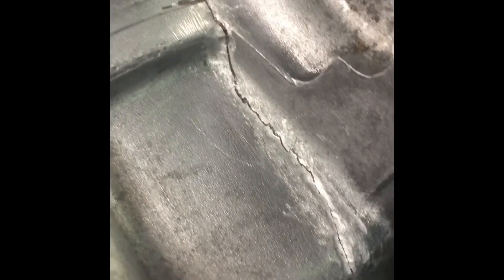We're back at repairing this crack. I've taken the Dremel and cleaned it off real good around it, kind of pitted it here and there so it'll stick and bond. I roughed it up real good with a diamond engraving bit, cleaned it all off, and ran some more of that acid around it and washed it real clean.